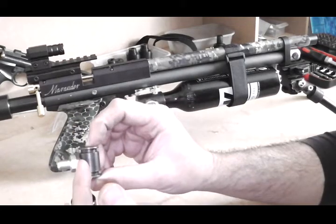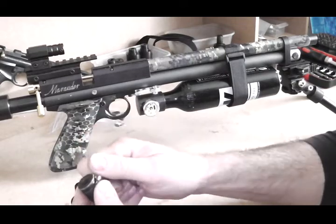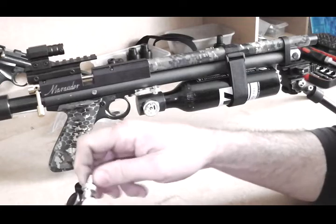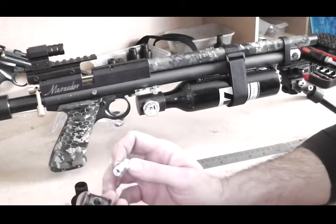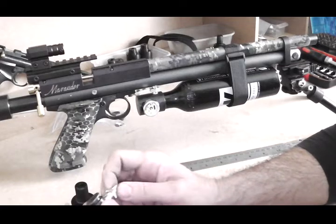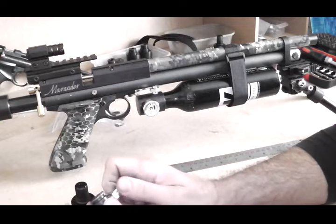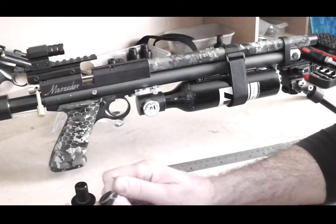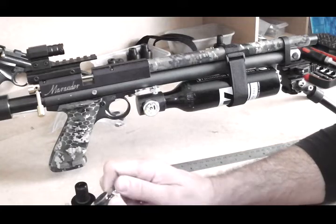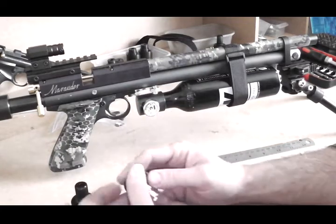What you're going to do is wrap PTFE tape around it to seal it — that's standard practice. If your hole doesn't go all the way through, you may have a crush disc — bored to a certain depth with a crush disc and an o-ring. Either way, just thread this in as far as it'll go, down onto the crush disc or o-ring, and it'll seal.